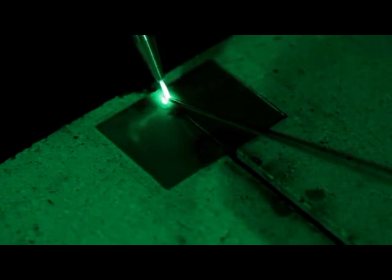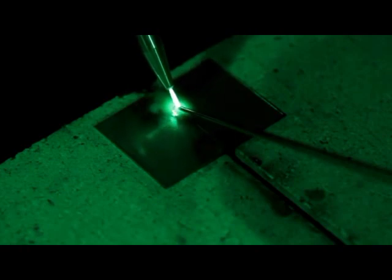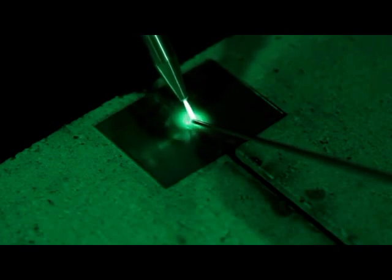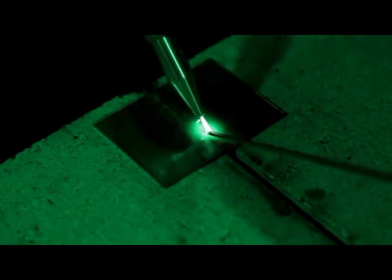All right, the same way. You can still use a dip in, dip out action if you want, but just lay that rod right down on the metal. I'm still using that little inner cone to weld with right here. You're just keeping that little cone, just sort of walking up the rod, washing it right back in the puddle.